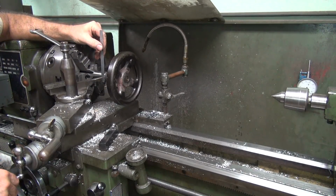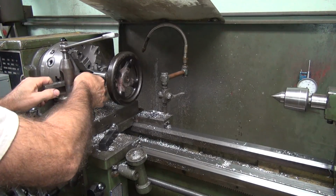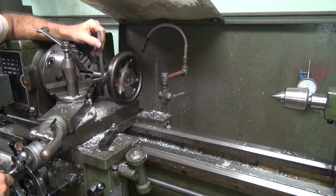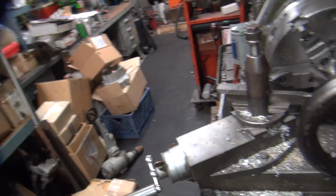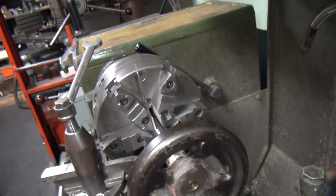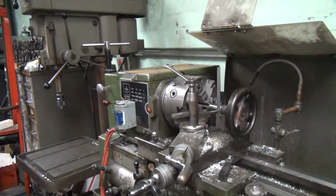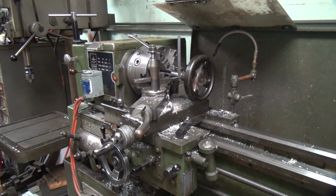Okay, this tells me if I'm low or not. In this case, I'm high, which is all right because I got an upward angle on my cutter. Low side, but we'll see. Actually pretty good. So if your tangent line's vertical, you're good. You look at the tangent line right now, it's slightly downhill, which means I need to come up just a little bit on my tip. If you're cutting hard material, that's good. We're cutting brass. Brass doesn't like negative angles on it.